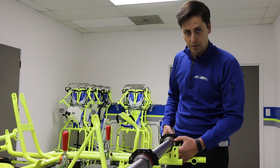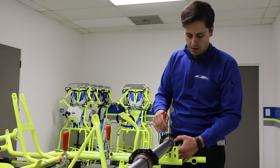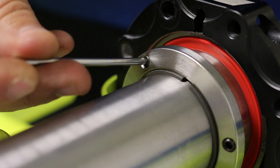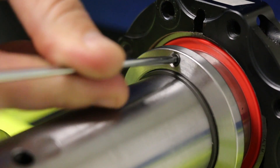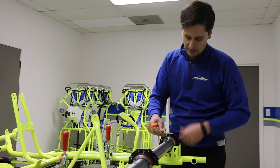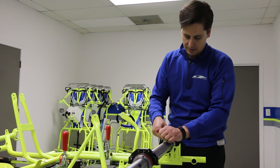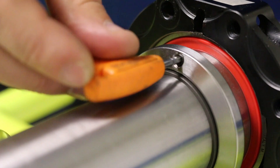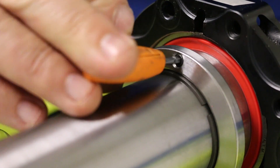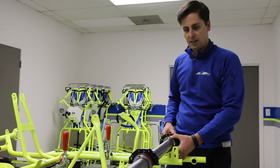We're going to tighten these down much like we would a standard set screw, except we want to offset the slit with the set screws — never align a set screw up on your slit, otherwise that could create an issue. So we're going to eyeball that and offset it. Much like anything, you want to evenly tighten all the set screws, just like an engine builder would on a cylinder head or on an axle collar — typically anything cylindrical. So we'll go around and snug everything up. Once everything's snugged and pretty tight, you always want to go to the shorter 90-degree end on your Allen key to get a little bit more leverage and tighten it down. Now we've successfully tightened our axle in place.